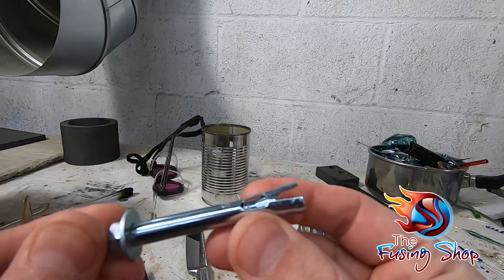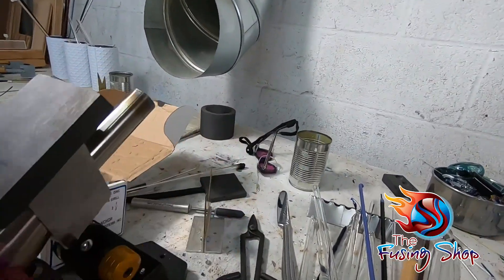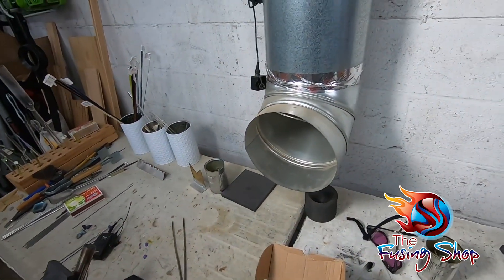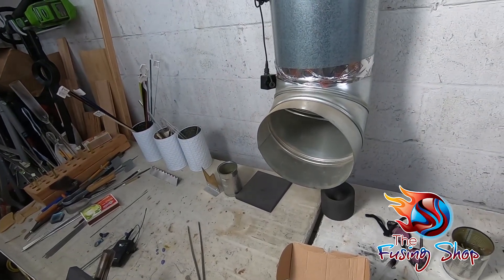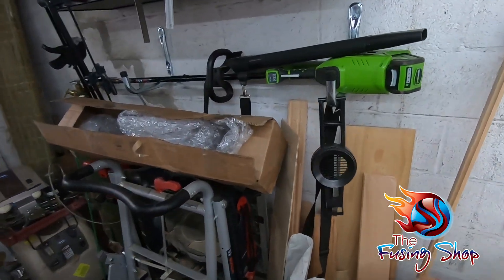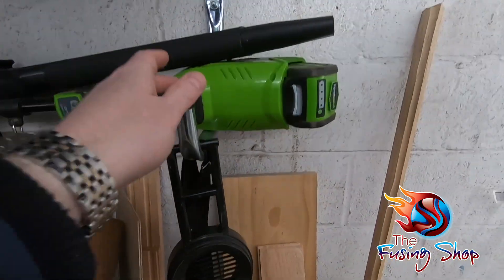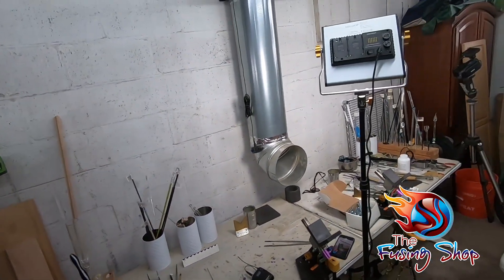You can see how much it's expanded — that's how I have my fan mounted to the cinder block. I use sleeve anchors for mounting anything to cinder block; they're very strong and I've had no problems with them. Over here I also have them holding up my hanger — one there and one down there — and it's holding it up super strong. Anyway, back to my ventilation system.